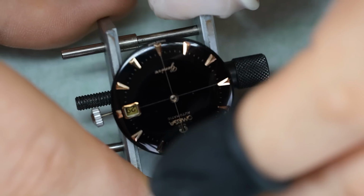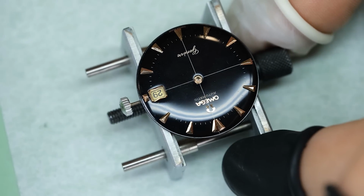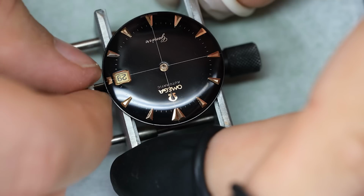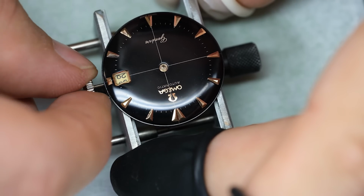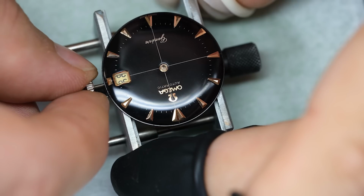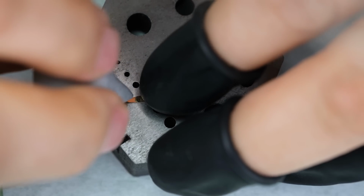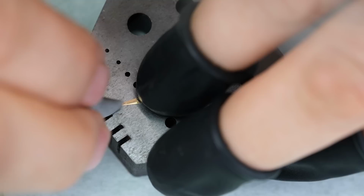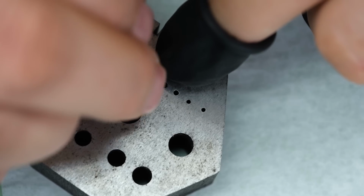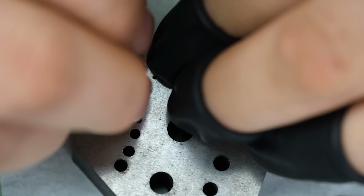Now, in the beginning of the video, almost half an hour ago, I alluded to there being something a little bit off with the watch. And yes, we did find something in the movement, but the dial has been refinished. So what that means is that someone took what was probably a very damaged dial, stripped it all the way down to the base metal, and then painted it, put back the indices and so forth, so that it looks as it does now.